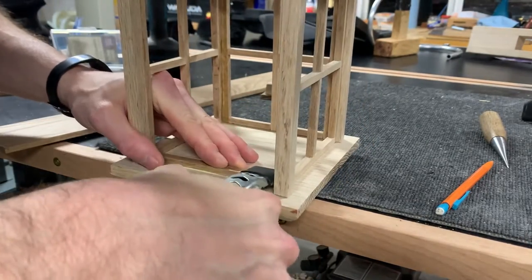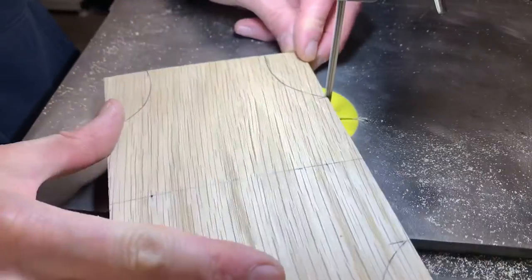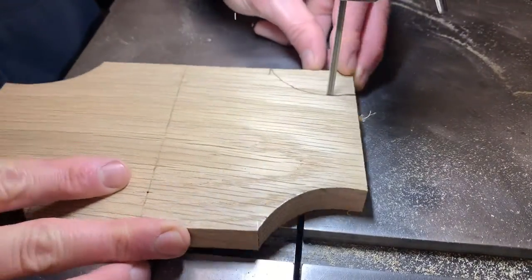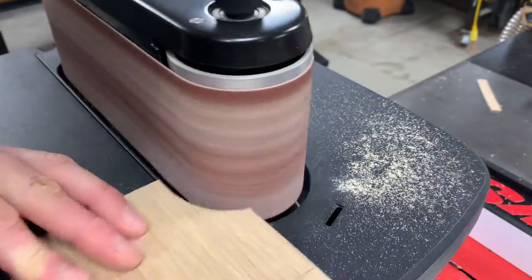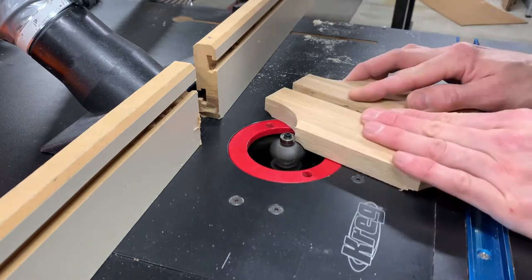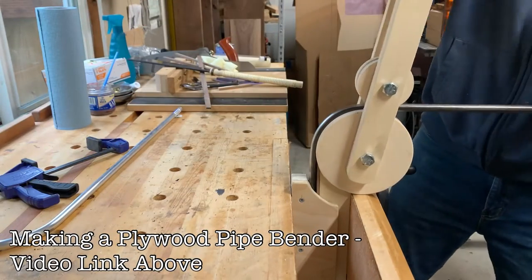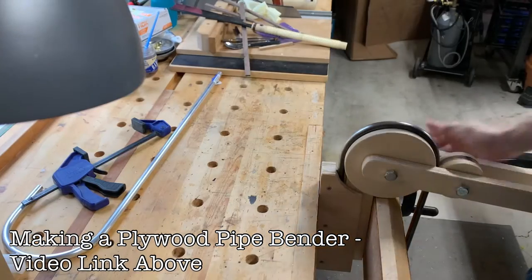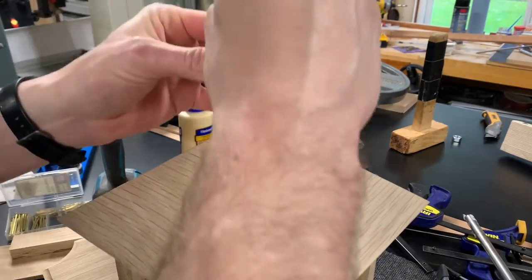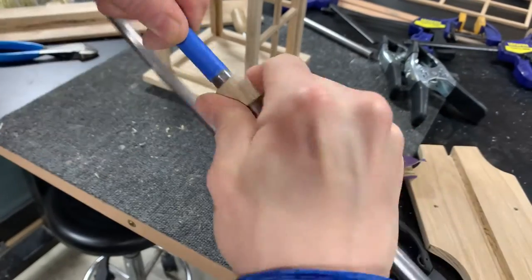Since this lamp was wall-mounted, I needed a way to attach it to the wall. After cutting a dado which will eventually hold a piece of pipe, I scalloped the corners and also routed a little cove around the edge. I bent some half-inch diameter steel tubing on my homemade pipe bender and made a little stop bushing off camera to attach to the pipe, so it wouldn't slide down through the bracket on the wall.